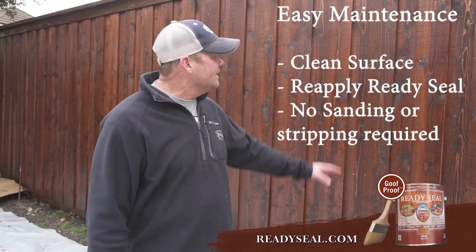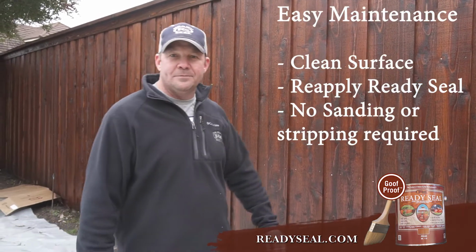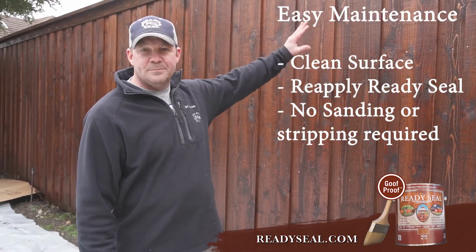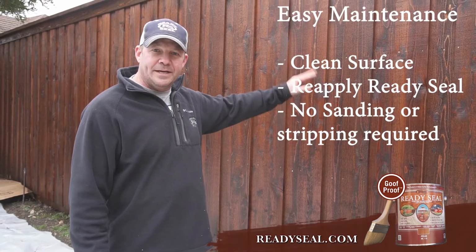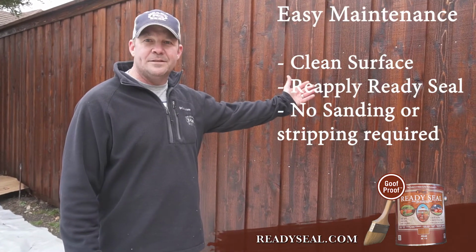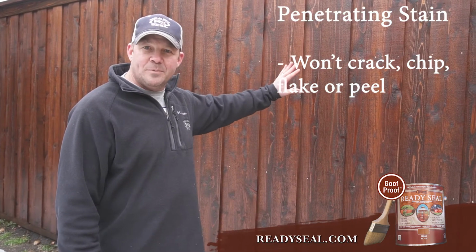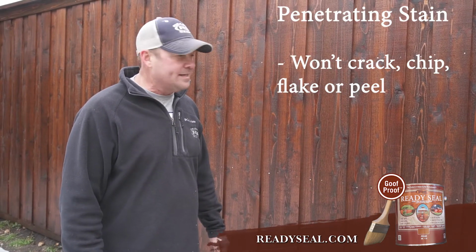Ready Seal has extremely easy maintenance. Once you've done a job with Ready Seal, when you get ready to redo it, 4 or 5 years down the road, the product just needs to be cleaned with bleaching water or wood cleaner, and then you can just reapply Ready Seal on top of Ready Seal. Ready Seal will never crack, chip, flake, or peel because it's a penetrating stain. It's not a surface coating.